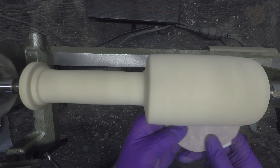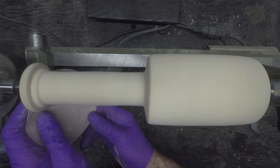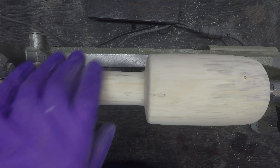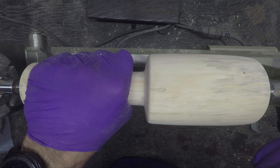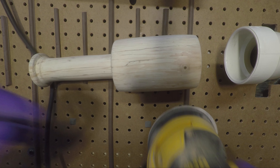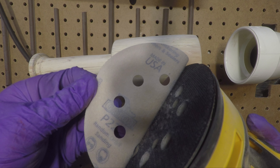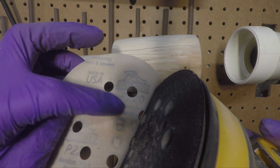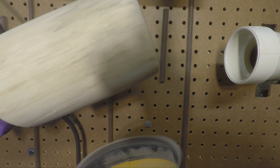I'm not going to be doing a video tutorial on how I actually made this wood hammer. There are several tutorials on YouTube already about making wood hammers, and some guys do a really good job on it. YouTube just doesn't need me to put another video out about how to make a wood hammer. So I started out with the 150 grit on the lathe itself. I took it off the lathe, brought it over to my downdraft table, and I'm going to be using a 220 grit dual action sander on this process.